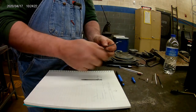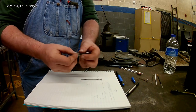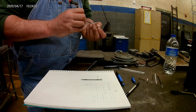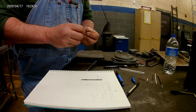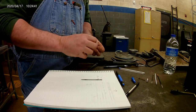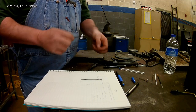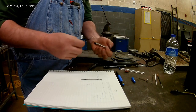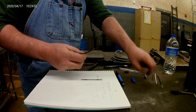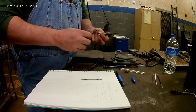Not that that really has anything to do with welding, but sometimes I just can't help myself. This one looks way different, so this one might be a problem — it's got a big barrel over here and a smaller one right here. That's going to be too short for us, so I'd have to modify a collet or possibly go to a 5/32 collet. So this one, even though it's my favorite pen, it kind of stinks for any simulated welding operations. That big old round end is kind of like what my tungsten looks like anyway once I get done welding.